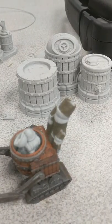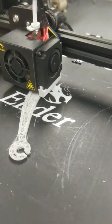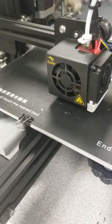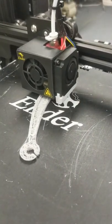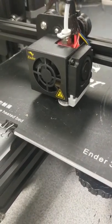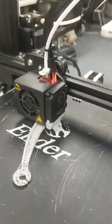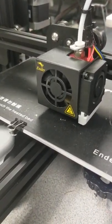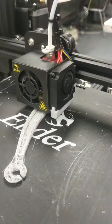You can see just how wiry and scraggly it is up there. So what would you do normally if you saw it like that? A long time ago I would have killed this print. At this point I'd probably wait until I get the thermal sock in, because that's the only variable that has changed. You're pretty sure it's just the lack of that tape or the thermal sock not keeping the heat in. Yeah. I could set the print temp from 200 up to 210 and just let it run hot — that might be a bit of a hack for the real solution.